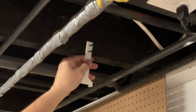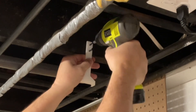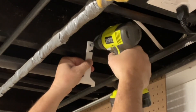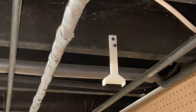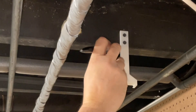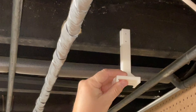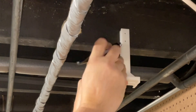So I can snap these on, and the next step is to mount them to the rafters. The advantage to using the four millimeter holes is these drywall screws screw in and hold in place but I can still spin them. I screwed in the top screw first and had to go around a pipe. Once in place I could pivot it and make sure it was parallel to the pegboard, which I did with a level. Then I screwed in the second screw and it was solid. I put a mark on the bracket right at the rafter, then brought the other bracket in and marked the same point.